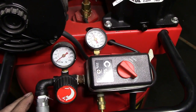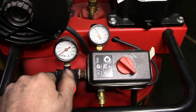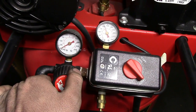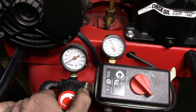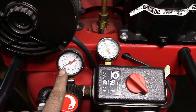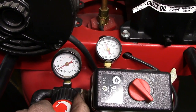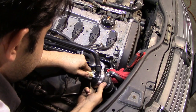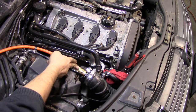Now we're pretty much ready to introduce compressed air. Here's a very important step: go to your air pressure regulator on the compressor and turn it all the way down to zero. Then very slowly turn it back up and first build to 5 psi of pressure, then attach your airline to our adapter. Once the pressure starts building, let it sit for about 30 seconds to get an accurate reading on the dial. Then attach the quick connect to our adapter and let it slowly build up pressure — point this away from your face.